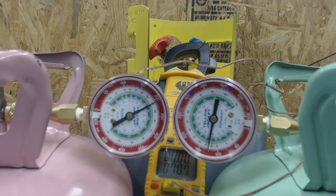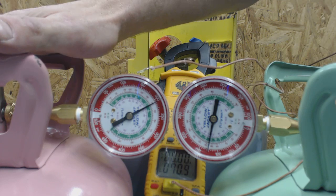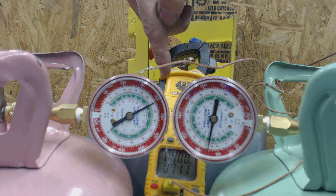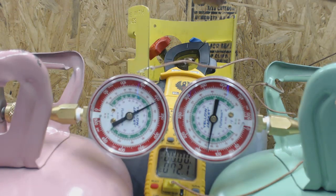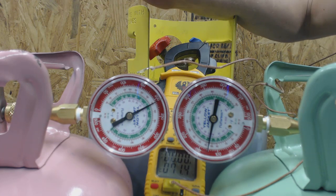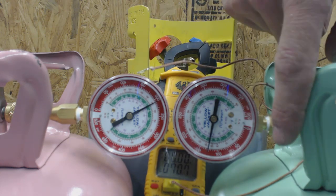If I know the room is a constant temperature of 71 degrees and the refrigerant bottle has been in here for several hours, I know the refrigerant is at 71 degrees. If I check the 205 psi reading against my pressure-temperature chart, it will tell me what temperature the refrigerant actually is — roughly 71 degrees — confirming it's R-410A.